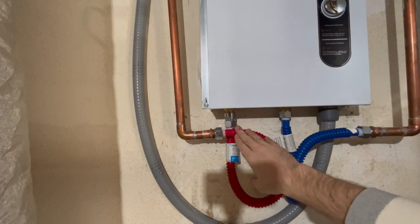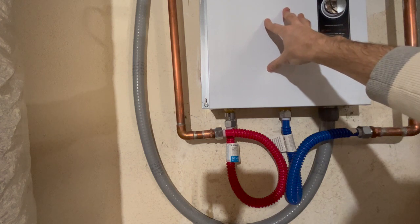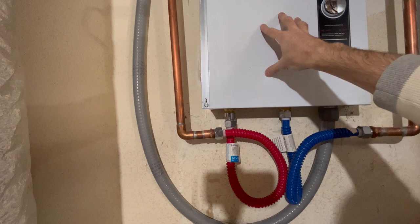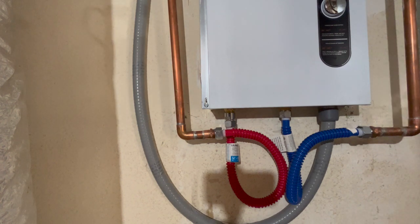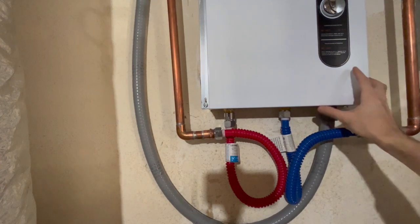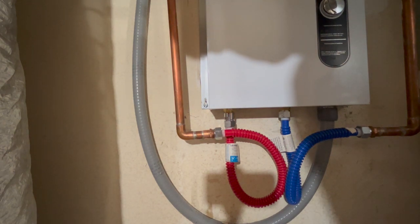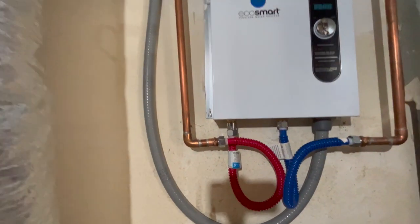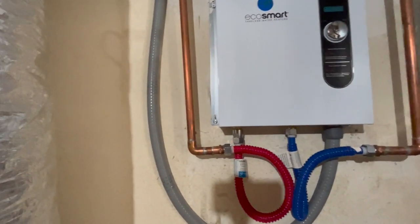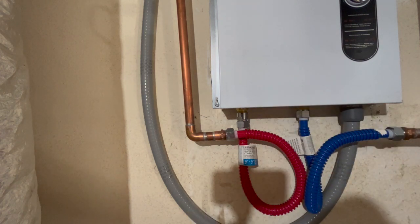Now that I've closed this back together, I need to run some water through this before I turn the power back on. If I turn the power on while it's just set up like this, there may be air bubbles that could cause damage to the water heater. So I've got my cold water supply line — I'm going to turn this on, and this will give me a good opportunity to check for leaks. Looks like we're all in good shape. I've got my bathtub on — the water is flowing but the power hasn't come on yet, and that's what I want. Just checking again for leaks — looks like we're all in good shape.